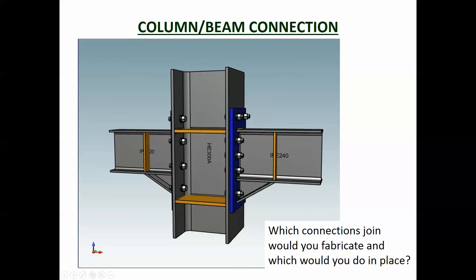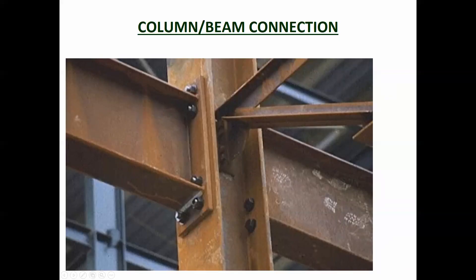Here's a picture of a beam-column joint — a bit rusty. You can see that the beams are bolted on and the plate is oftentimes bigger than the beam, to allow you to get a few more bolts in there. The more bolts you have, the stronger the connection — and that's one of the key design points.